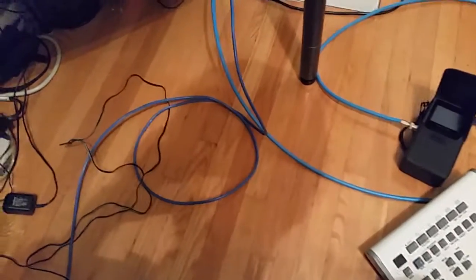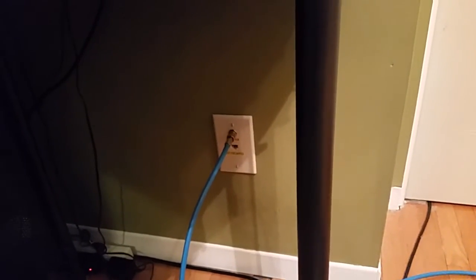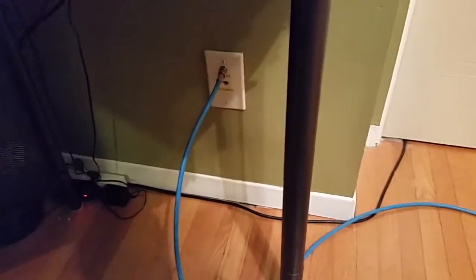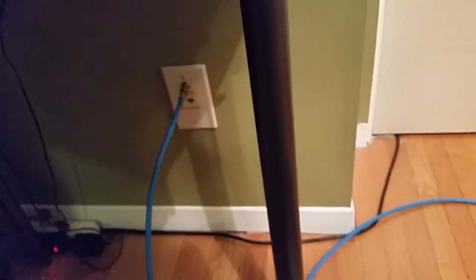This is basically going into the back of the CM6800E 48-by-8 matrix switch. It's a long cable that connects the back of this jack to COM ports five and six — those are the two that can directly power the KVD 300A. You just plug in a patch cable and it goes. Now when the cable distance is over 25 feet, you need to use the KVD wiring kit and splice in a 12-volt power supply to compensate for voltage loss. The Cat5 I'm using is very thin gauge pulled behind the walls, and surprisingly it still works.